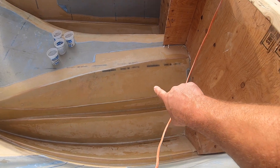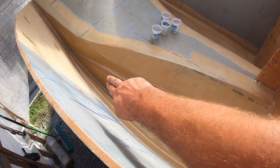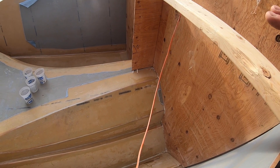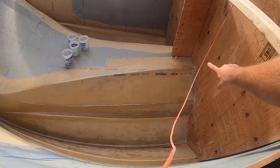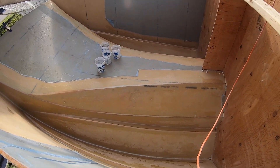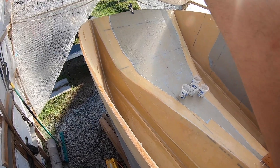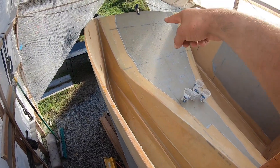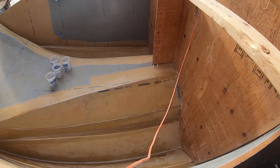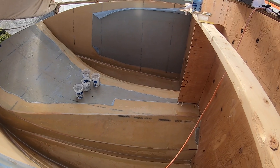Over here will be seen, and we can just fair that out quickly. The floor comes up to somewhere in this area, comes up to a point, gets wider in the back, and then the rear bulkhead. From there back, really everything below the floors is just storage. This section right here — all the way up to the top of the bridge deck — is basically the most area you're going to see. Most of it's going to be covered. There's a bulkhead in the front that constitutes the impact zones on both hulls, and then the anchor locker and chain locker. Everything looks good, everything went smooth. First batch kicked a little quicker than we wanted, but we found a better method. It feels nice to do glassing again.